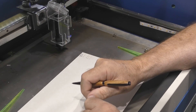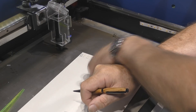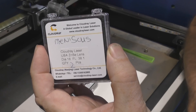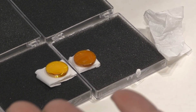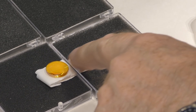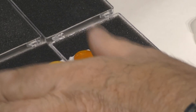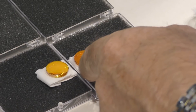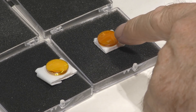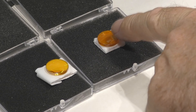Inspecting with my eyeglass, I would actually say we've got the best results at 2mm. Bear in mind this is a meniscus lens, where the focus is supposed to be crisp — we're not expecting to see too much by way of a halo. While we're doing this test, let's swap lenses and change to the USA CVD lens. If you put these two lenses side by side you can immediately see the difference — this one is much more of a toffee colour and this one is a lovely yellowy golden colour. That's one of the ways you can tell the difference between PVD and CVD: PVD tends to be this slightly darker brown. If they get any browner than this they're probably lower quality — really dark brown lenses I wouldn't want to put more than about 40 watts through.